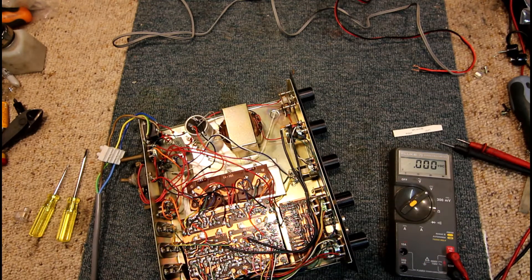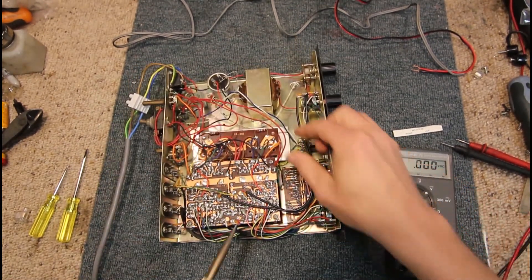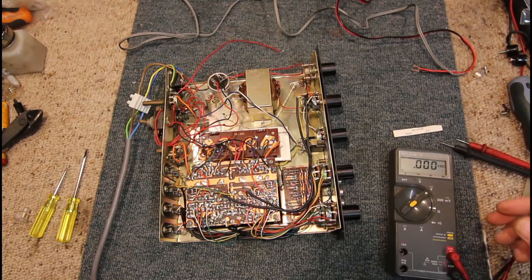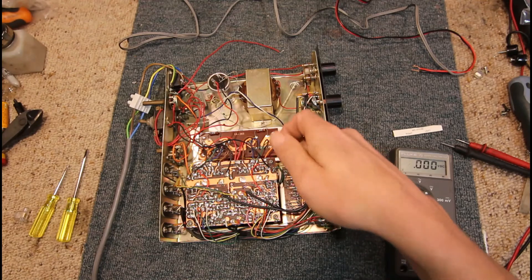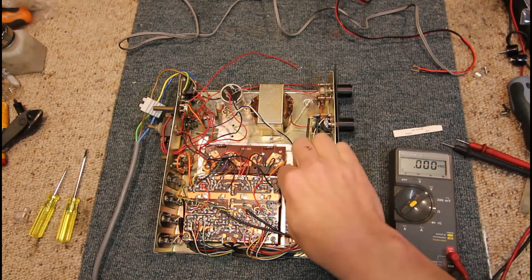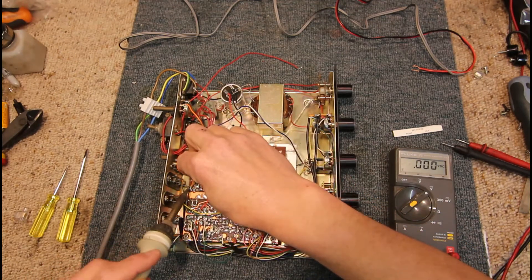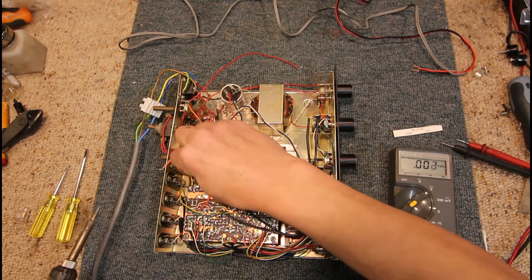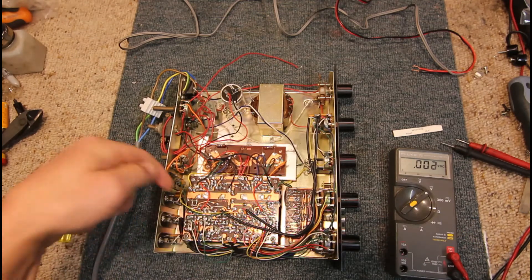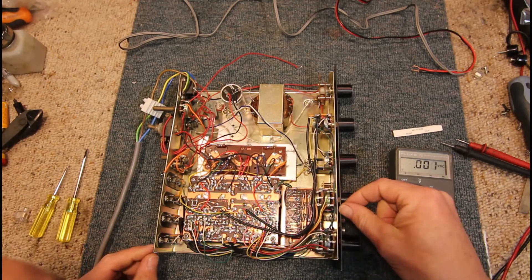I'll fire up the soldering iron and remove some of this wiring and see what happens. I've obviously turned the power off. I'll get rid of these red wires — pots and switches and all sorts of weird stuff. We've just got a green wire here which comes via a 1000 microfarad capacitor — an electrolytic 16 volt — that goes into one side of the headphone socket. This extra original wire on this side is basically the same; the circuit board is symmetrical, each channel a mirror image. So we've got a 1000 mic capacitor on this side and a yellow wire going to the headphone socket.